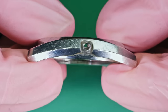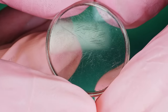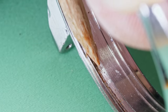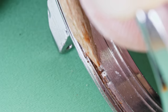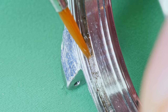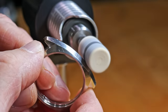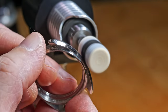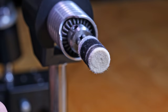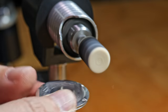The case looks like a piece of scrap metal — it needs polishing, it needs to look presentable. I think it's had a tough life. The crystal — we can polish that. There's a lot of rust in the slot — I'll remove as much as I can with pegwood shaped to fit the slot, soaked in horosolv. Whatever rust remains, I'll brush some rust remover there — just in the slot, nowhere else — and leave it for a few minutes. That looks much better. I'll polish the case, the case back, the crown, and the crystal. If you want to see the polish in more detail, I'll put a link in the description to my previous video — it's all there: which compounds I'm using, how I do the brush finish, how I polish the crystal.